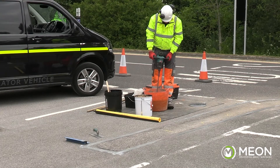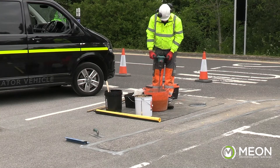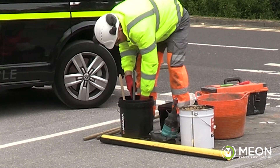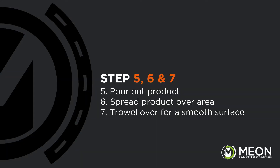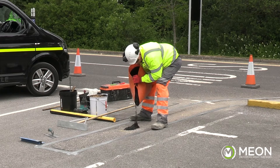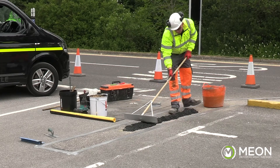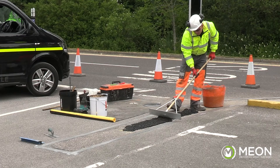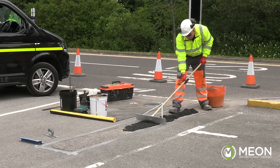The equipment should be cleaned immediately as this product will cure quickly. The Permafix L271 is now poured into the areas marked for deep fill and spread evenly using a metal spatula. This then needs to be troweled over to compress it sufficiently and produce a strong bond.